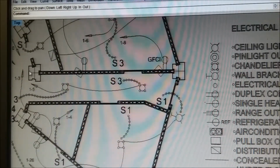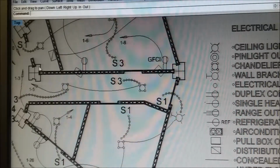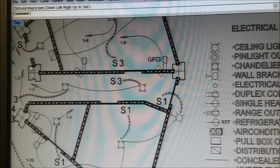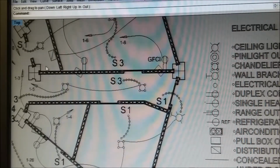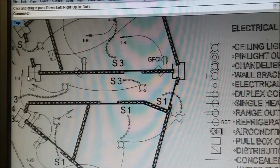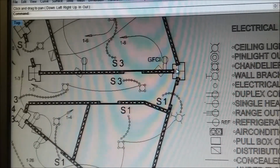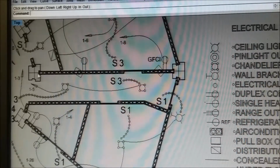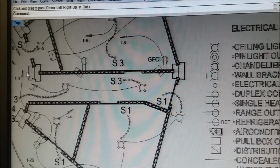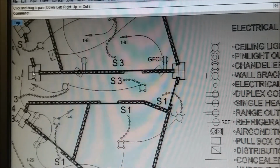This column and this column use the exact same form to make them, because the panel for the form is pretty much straight across here, that makes this panel and that panel the same length, because they're going between the other 2 panels. So that lets you just turn it around and put this one over here and this one over there. So we made 10 of these, and then we come back and flipped them. We have to take them apart to get them off and put them back together. So we flipped them and made the inner ones out of the same form.